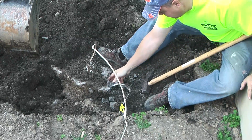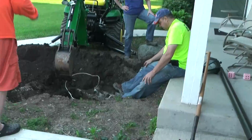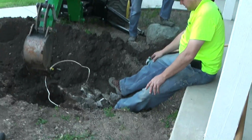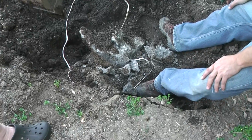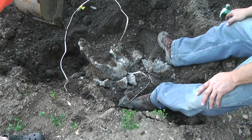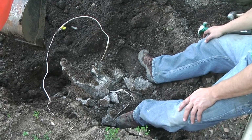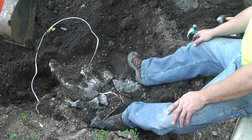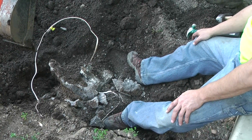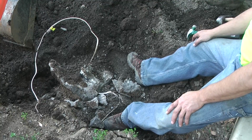Stuff flying everywhere. You see how the lime seeped up into the pole itself, and that's why it caved in. I also didn't even know this until the other day, because they had three repairs up at Westfield Lighting, all of them in the same situation. All of them put them in concrete, and these are direct burial poles. You don't put them in concrete.